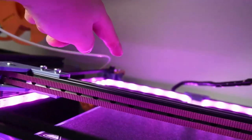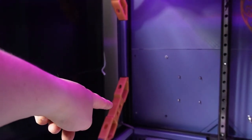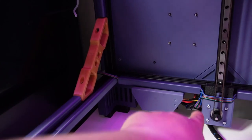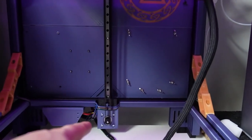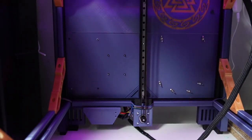So also the Y axis here, that motor has a cable that goes from there to the trunk on the side, goes down, and then you see the cable peeping from here, goes also in the same trunk to the back. Same thing with the right, the X axis, and also the motors from the back here and the front Z1. So the Z1 and the Z2 cables are being led by the trunks. I will put the trunks also in the link in the description below, because they are not on the Scaleable Rook download page, so you will have to download those separately from Thingiverse.